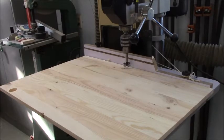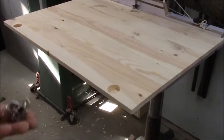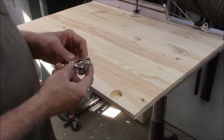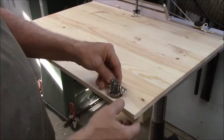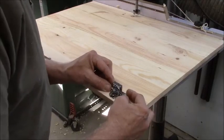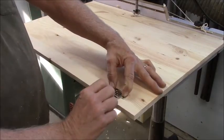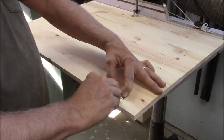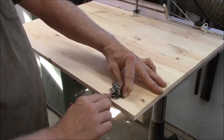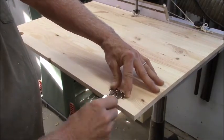To iterate: I'm using these — these are real Blum hinges, the good ones. These just hook over the edge of the door and they fit right in here. You line them up with a square or something, then put your two screws right in here, and this screws into the door frame. Then your door slides over like that when you open it. In the closed position, that's three-quarters of an inch from there to there, which is what I compensated for. So let's hope it all works.